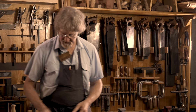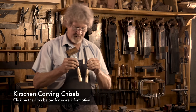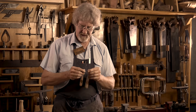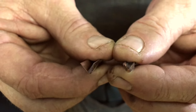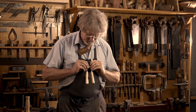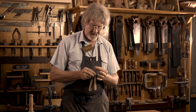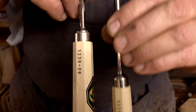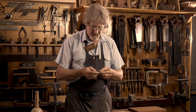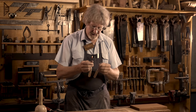What we need for that job is a V-tool. So here's a pair of them. These are nice Kirshen German-made ones. It's a V-shaped carving tool and there are different sizes. This one — the four means it's four millimetres across the top end. This one here is six millimetres across the top. They're beautiful and it's just such a simple tool. I'll show you how it's done.